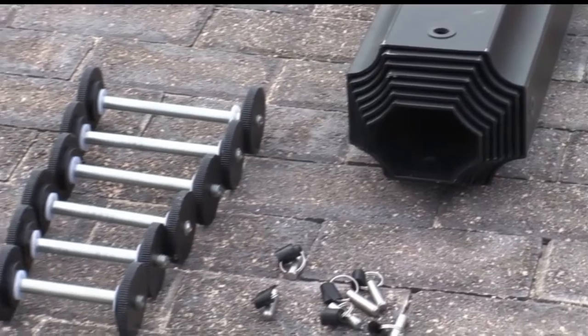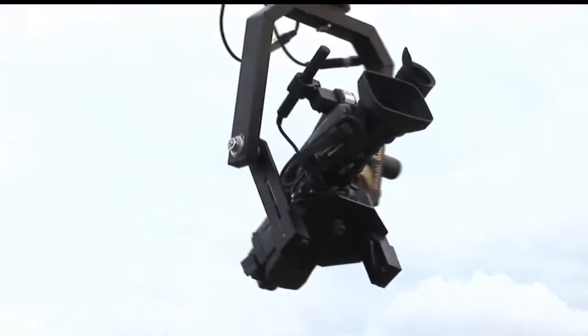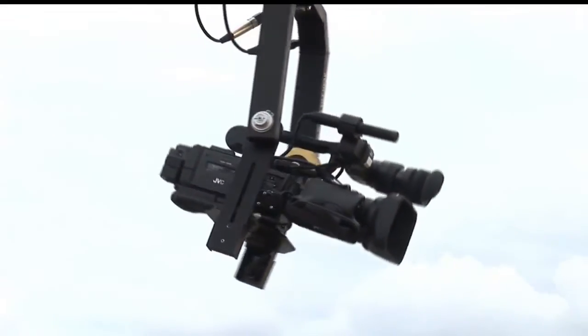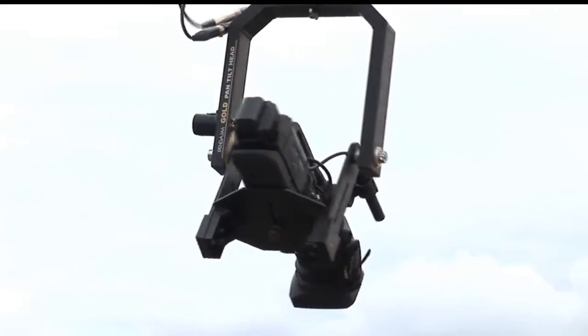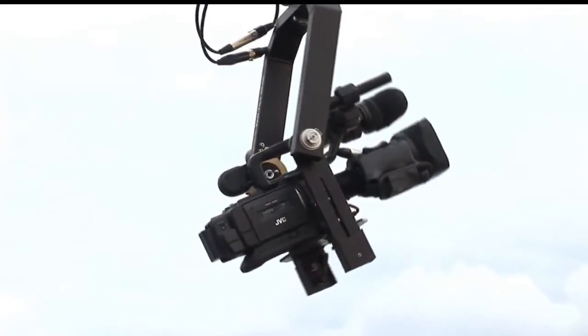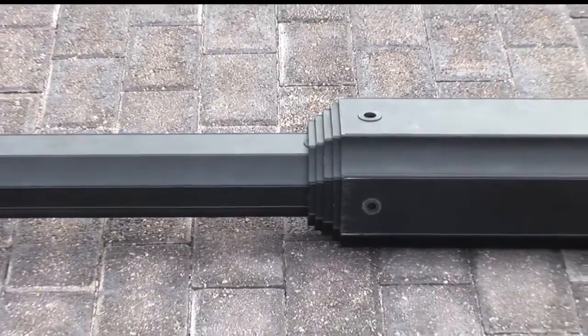This means that it is basically quite a big crane. But what if you need a shorter crane than that? You simply extend less sections. What's more is, you leave the unextended sections in the tail, which means you need to carry around less counterweights for ballast. With less extensions, you can have a crane which offers varying lengths.